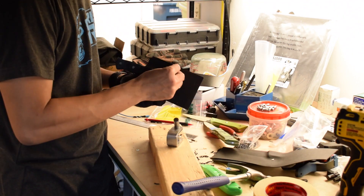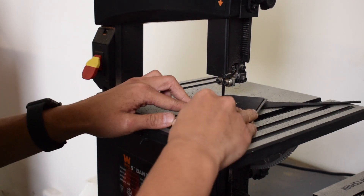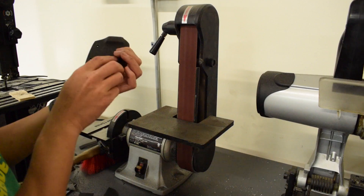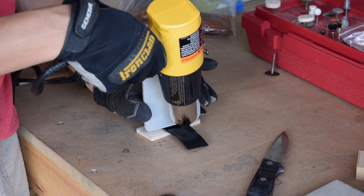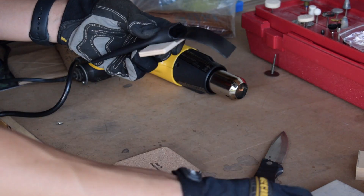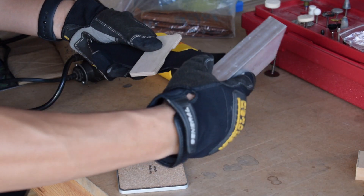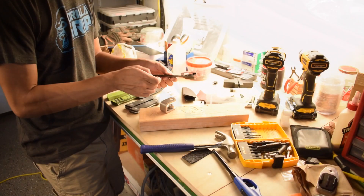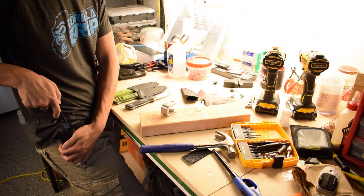Once you have a workable sheath, drill and rivet along the edges. Both of these sheath designs will need to be cleaned up on the bandsaw or belt sander, but with how easily this stuff melts, I recommend you do the majority of your material removal with the bandsaw — otherwise you'll have semi-molten bits of Kydex raining down on your hands. The tail that remains for your clip will need to be molded around a surrogate for your belt. I have a little piece of scrap plywood cut to 1.5 inches in width and machined in a shallow saddle shape to roughly match the contours of the knife. This lets me get a relatively low profile clip once I use a heat gun to form the Kydex tail. If you want more details, I encourage you to check out the videos linked in the description.